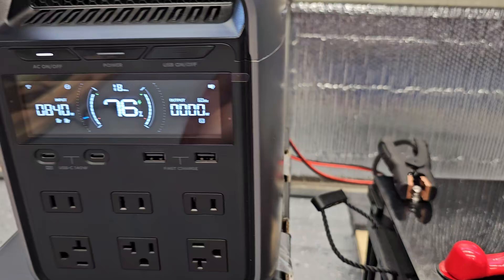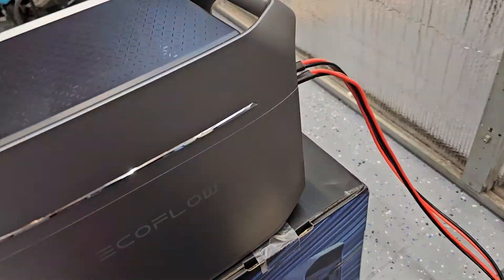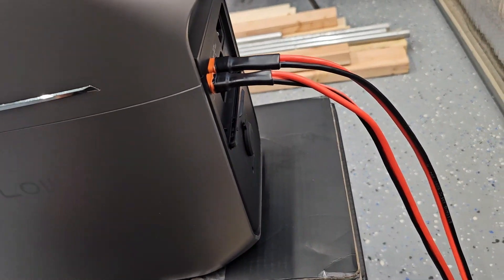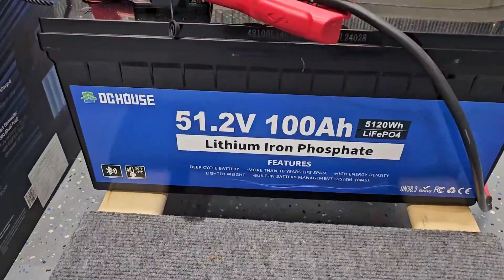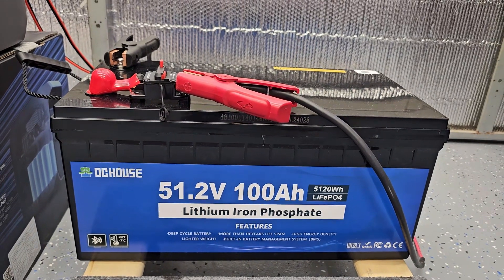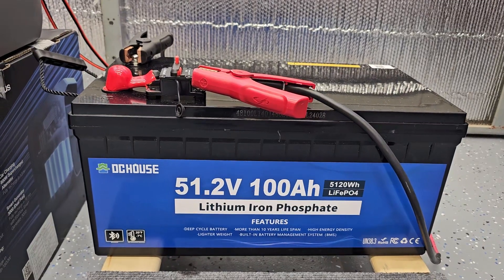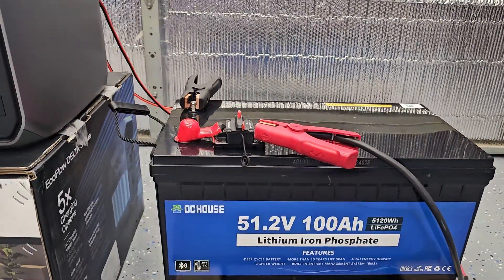It does work — the big question is now answered. These two DC inputs can be powered by one strong battery. Just make sure your battery can handle more than 20 amps of load, because you're essentially combining 10 plus 10, or 8 plus 8 amps.